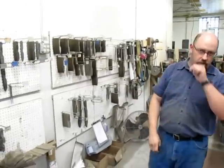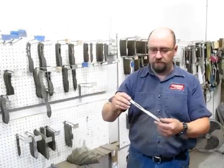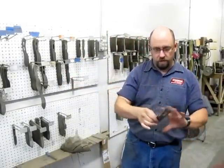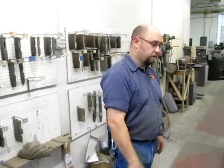More knife blanks — these are back from Waterjet. Most of these knives, like this Brumby here, get cut out for us at a Waterjet facility. Then they get sent here and we flatten them, stamp them, grind them, and get them ready to go to the next step.